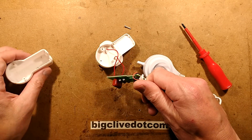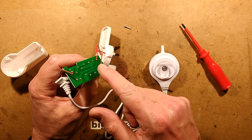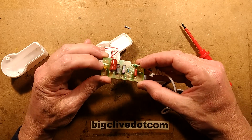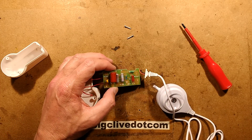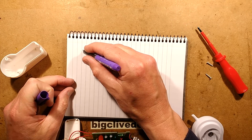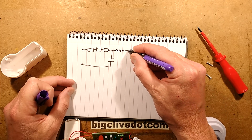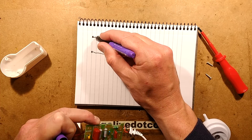It's different to the last one. Does this capacitor have a discharge resistor? Yes, it does look like it does. So what do we have here? AC 230 volt input, output says AC 120 volt. F1 fuse — that's interesting. It looks like — I'm just going to sketch this down and follow it out and see how it compares to the previous one. The previous one was based on three big resistors in series, then a capacitor, a small inductor, and then it went out to the piezoelectric disc. That one also had a resistor across there.